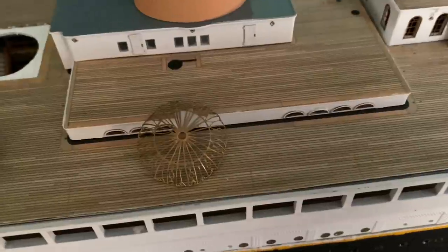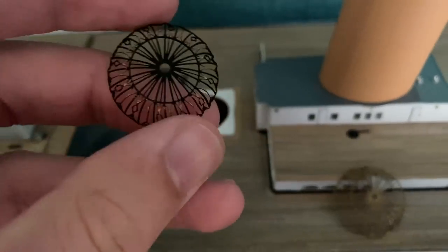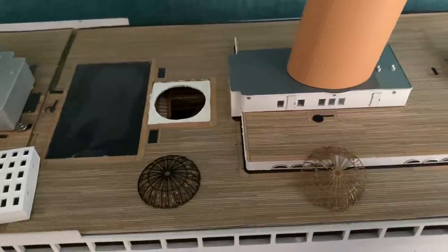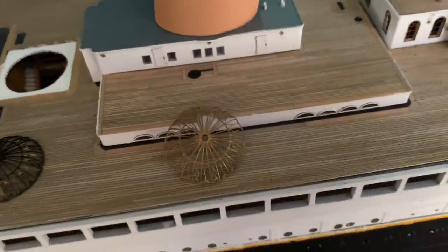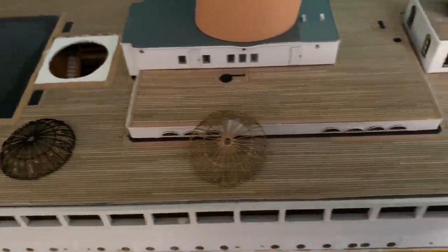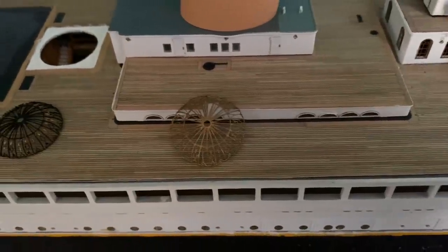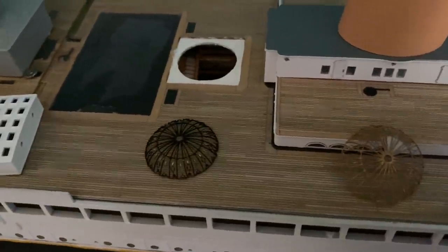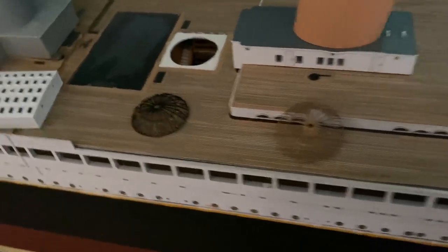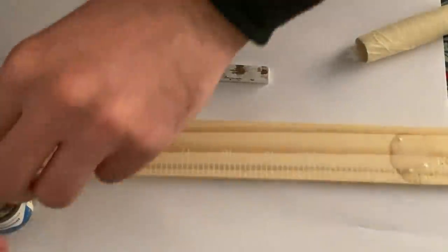I've done enough testing on this piece now to be content that it works and is a sound principle. So we'll move on now and do this. I'm going to film it in fairly low light because, of course, the problem with UV resin is that it wants to cure. I need to produce UV resin with some white paint in it, and I want to do it all in one batch, because if I make one batch, do half the dome, and then it cures and I have to make another batch, it's very difficult to mix the ratios again so that you get the same level of frostedness in the second batch, if you see what I mean. So I'm wanting to do it all in one go. Filming in quite low light gives me a bit more time to work. So we'll crack on with that, then we'll get the dome in place, and then we'll do the finishing touches to the cover.